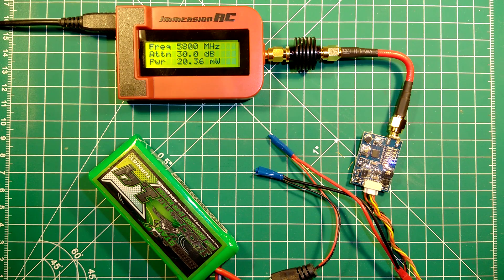We've gone through all the channels and completed the full set of RF power measurements, which are also linked. This concludes our review. The transmitter sometimes gives you even more than the promised 25 milliwatts, and sometimes slightly below, but it fully delivers on its promise. It's a really lightweight, small 25 milliwatt transmitter with a push button control and an included microphone. Links are in the description — please leave a thumbs up, subscribe, and see you next time.